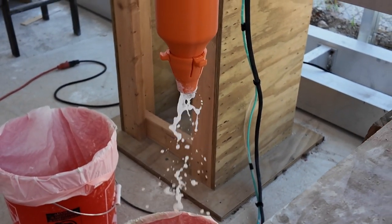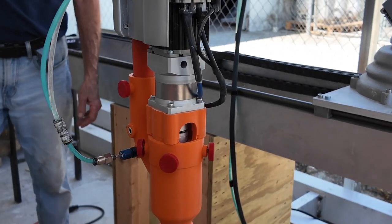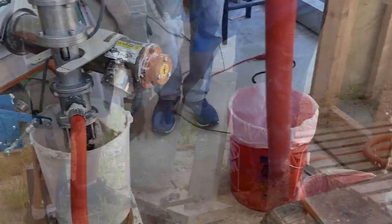If you are using a mix cell with accelerant, shut off the accelerant flow, but keep the cement pump and mix cell motor on and flush the mix cell. For a full tutorial on our mix cell procedure, please check our mix cell video.